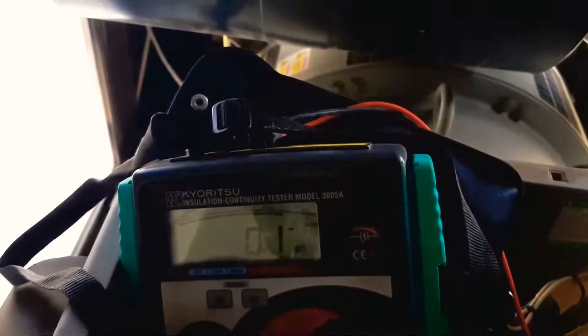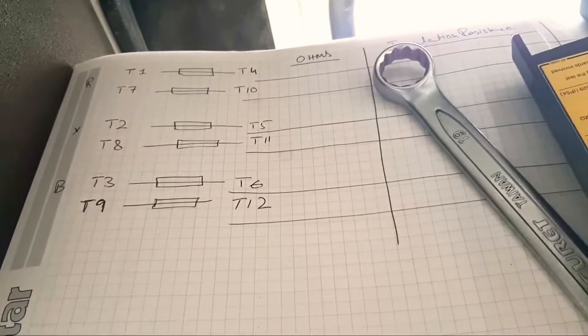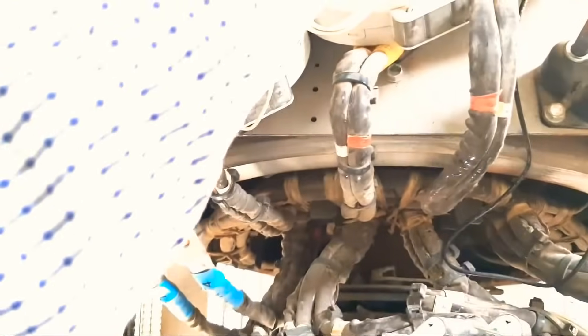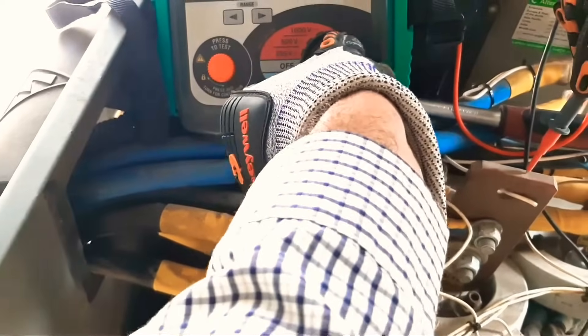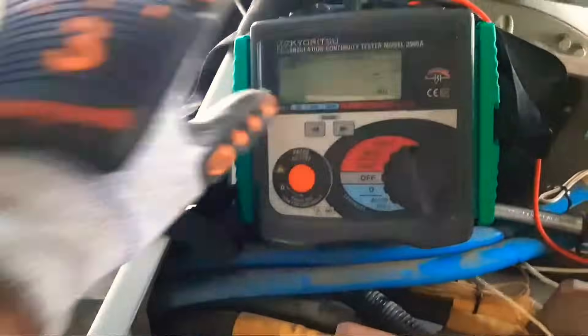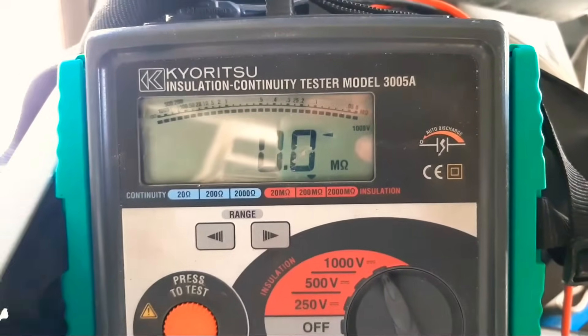This is how we check all windings. All are low resistance — only t7 is having high resistance. Now we will check t2 with t5. T2 and t5 are one cable. I connect on t2 and inject the voltage — it is showing 0.0, which means there is no resistance.